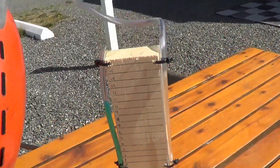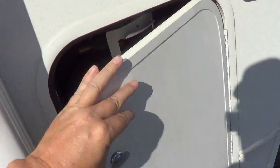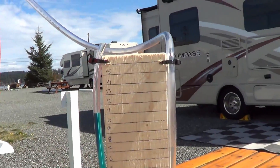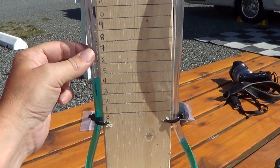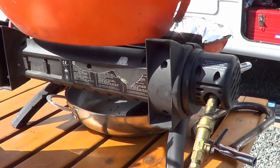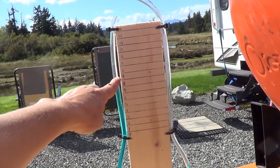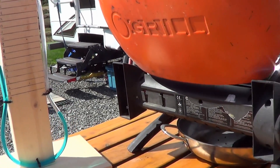Let's try turning off the main propane and see if that's going to hold. Turn that — so now we have no supply. We'll just see if we get any drop, indicating a leak. In fact, we do have a leak — it's been slowly dropping all the way down. So I have a leak in the system somewhere.